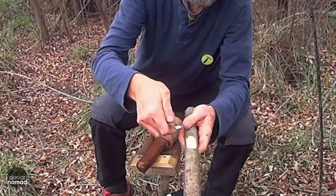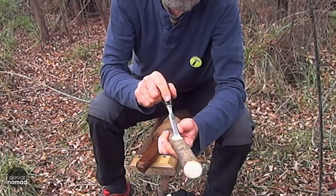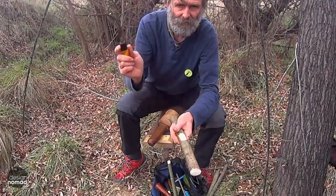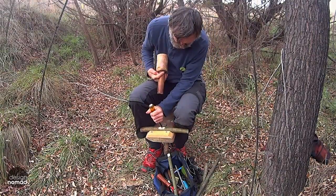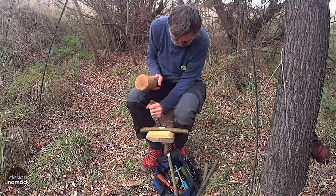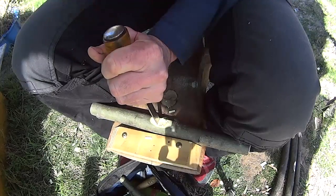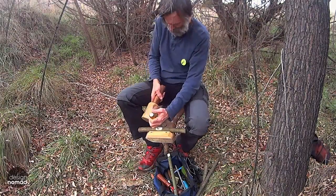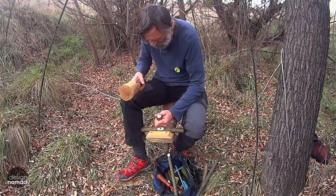Now the width of the tenon, the width of the mortise hole, is absolutely set by the width of my chisel blade, and I'm only going to use it for cutting cross grain. I'm really going to be very much trying not to cut down this way because it just won't be necessary. Won't be cutting with the grain at any point in time. So we just get there and we start back with the very first one again. Put it back in that same hole. Bump once, down a bit, bump twice, and turn it around. Turn the work around. So we take the flat surface against the end of the mortise hole.